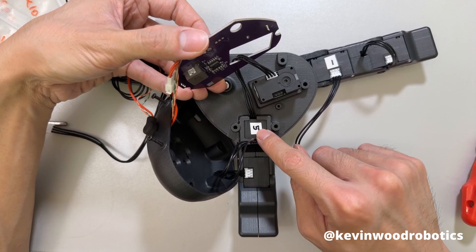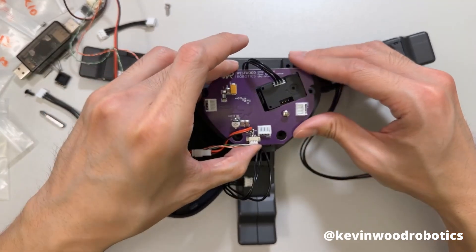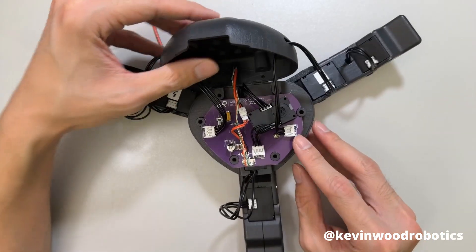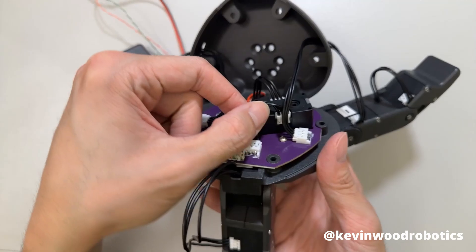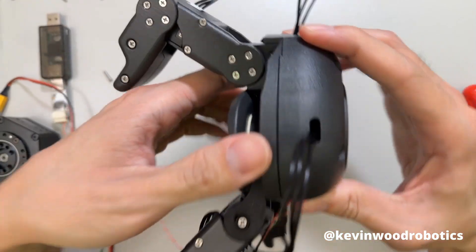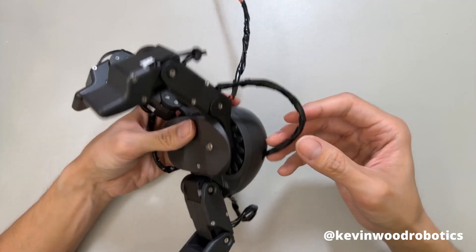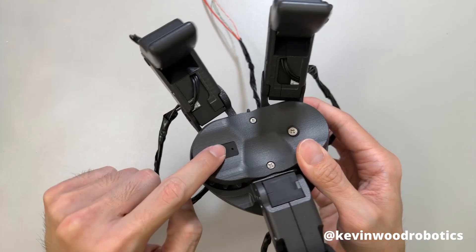Take the cable from motor 5 that was not used and connect it to ID 7. The power board goes right on top. For the final cabling, take the cable from motor ID 1, pass it through the hole in the shell, and connect to the right side. The same process happens on the left side for motor ID 3. For ID 7, the short cable connects here. Secure the shell with screws to tie it all together. If you have a bare actuator, you can mount the bottom of the hand to it for wrist rotation. As a final cosmetic step, wrap the cables with tape or spiral wrap and add a cap at the end.